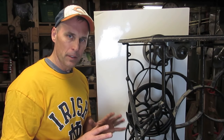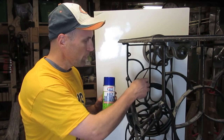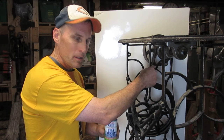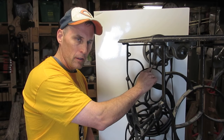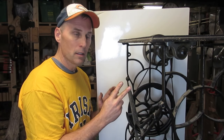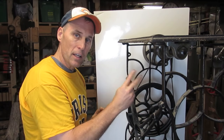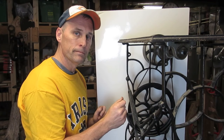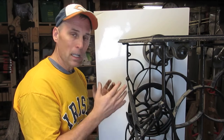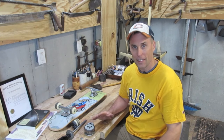Things are starting to get a little complicated. I've already sprayed the parts with belt dressing, which will make it sticky so the belt won't slip, but I still need an idler and there's not much space. I have two requirements: I want it mounted from the top so nothing gets in the way, and I want it to be adjustable. That was a real challenge, so I had to come up with some pretty creative solutions. Let's go over the idler design in detail.